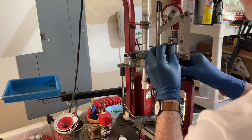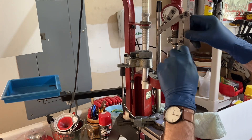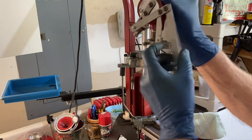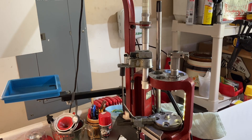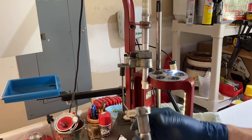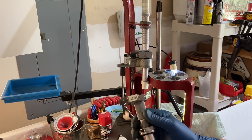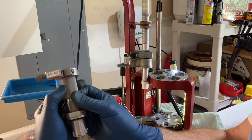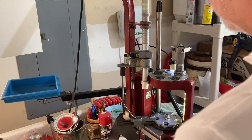You get one of these die bodies with the press and the powder measure, and you can reset it every time you change cartridges. But the more efficient way is to unmount the powder measure from the die body. I've got each of my powder measure die bodies for each cartridge that I load, because they're set up to the cartridge length. I'll take out the insert and replace it with the 44-40 die body.